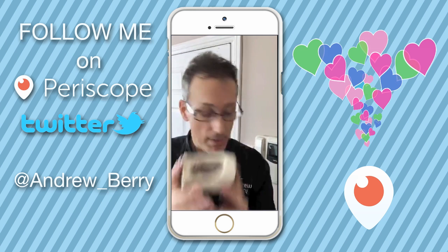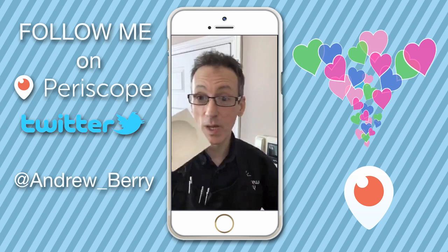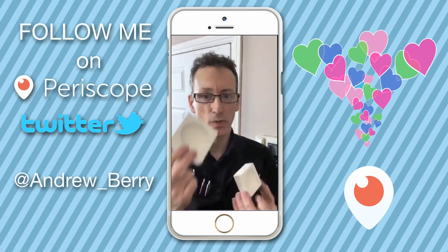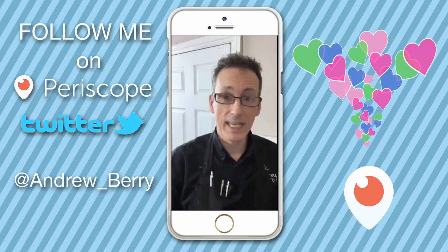When you're melting down we've got rectangular — square — crucibles: a three-inch and a two-inch. What we need to do is heat them up, and then we're going to sprinkle borax onto them.